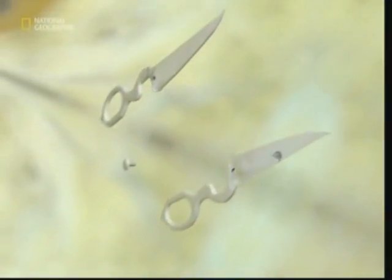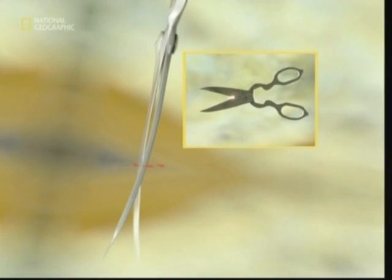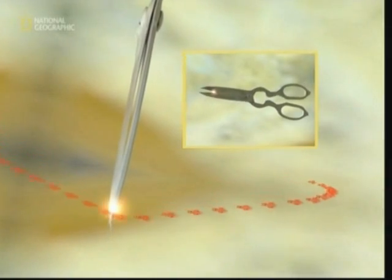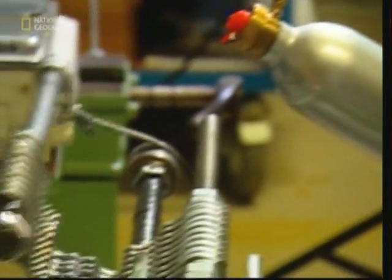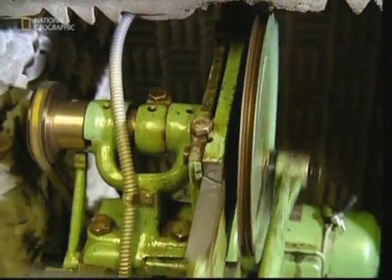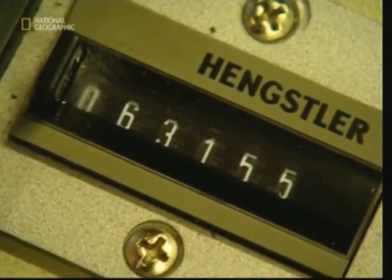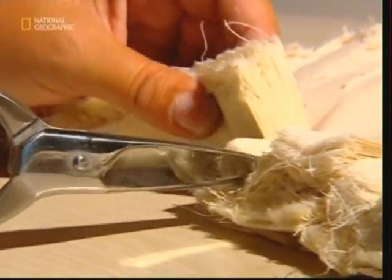And here's where we learn the secret of high quality scissors. Well-made blades have a slight inward curve, so they always touch at a specific point when they close. This maximizes their cutting potential. A gap between the blades would allow material to pass through uncut. To ensure this point of contact doesn't ever damage the scissors, tests are regularly conducted on samples. They're opened and closed 80,000 times. Even after all that wear, the next cut should be just as good as the first.